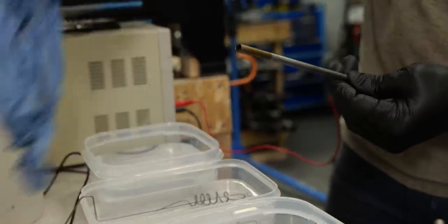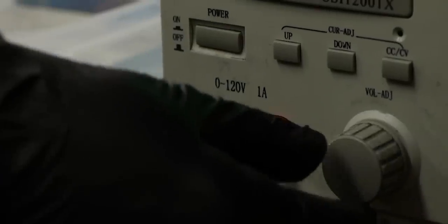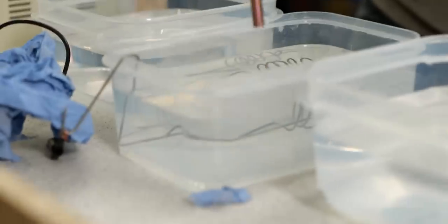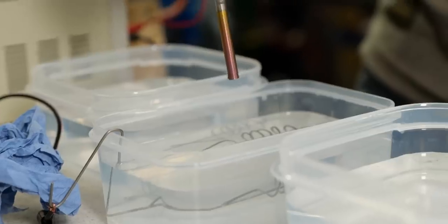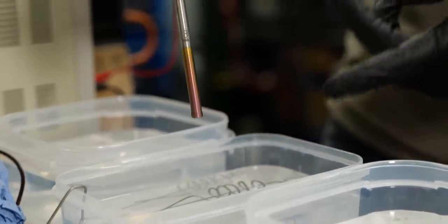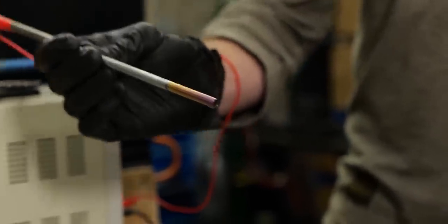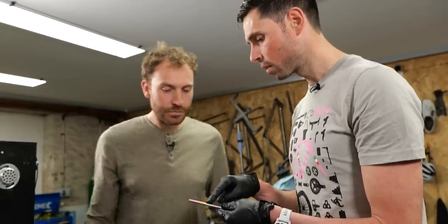If we dry that, you'll see that's one of the lower voltage colors. We can then start raising the voltage to get different colors — starting to get towards gold. You can produce a fade just by controlling how long it's in the bath. If we dip it in and out, you get a little bit more exposure to the voltage at the bottom than at the top, and you can get a color gradient. It's looking almost how I'd like. If we rinse that off and dry it, that's amazing — you can see where we've dipped it in and got that change of color.